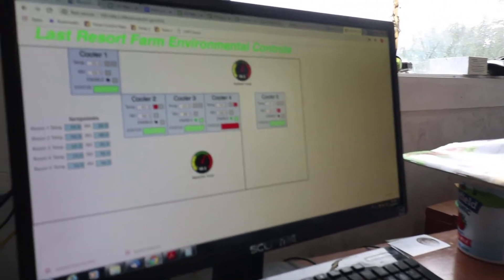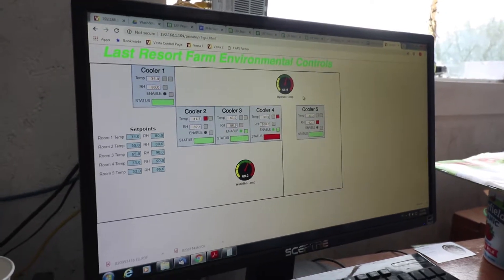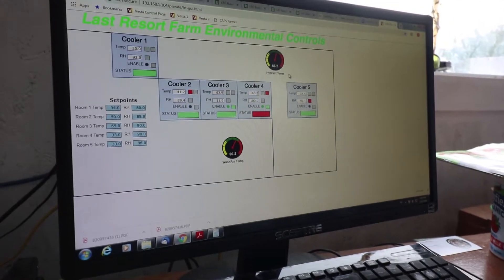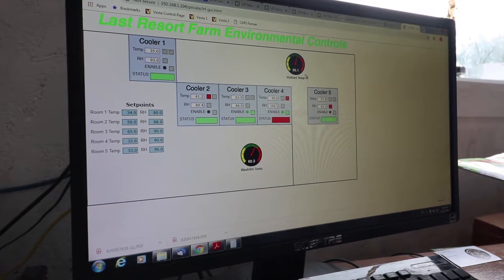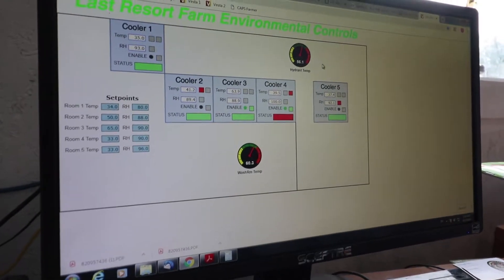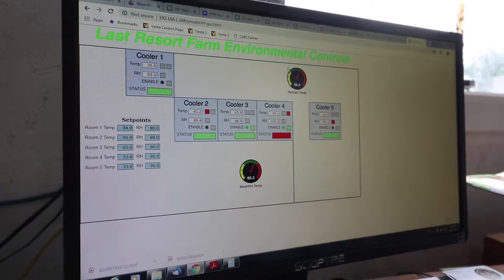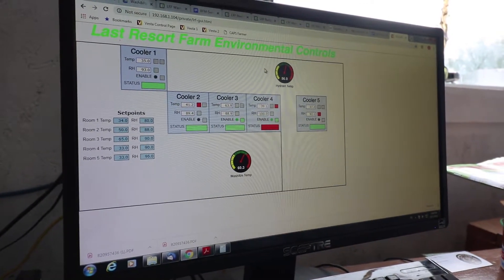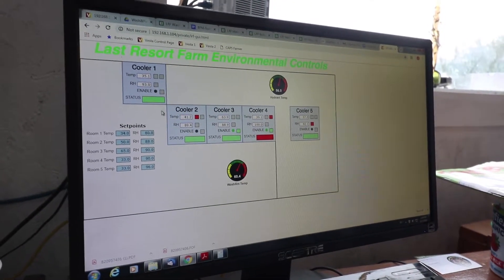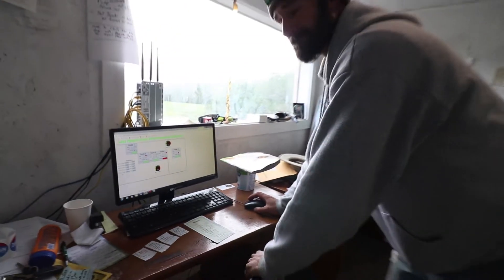You can see the room temperature and washroom temperature on the master page. Our water supply comes through a frost-free hydrant. If it were new construction it would have been more convenient, but we had to chisel out and jack around some concrete to put the frost-free hydrant in a less-than-ideal place. We have to be careful about it freezing in the winter, which is why we have a temperature monitor on it.